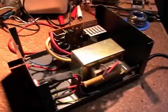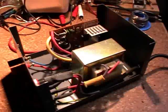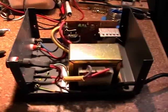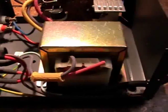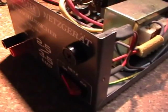And that's really why I prefer looking into those units before plugging them in. I think now we can try and plug it in, because I've disconnected these diodes from the rest of the circuitry, so that should be safe now, so that we can at least find out what voltage this transformer gives. I've also tested the fuse, and it's still intact. Now the power supply is connected to the line, and let's turn it on.